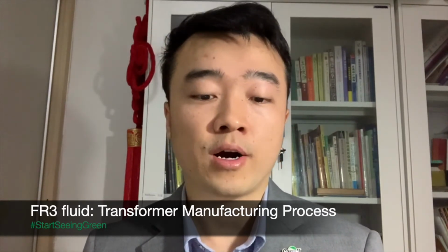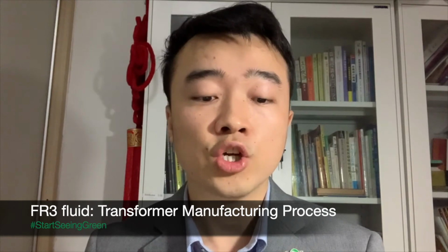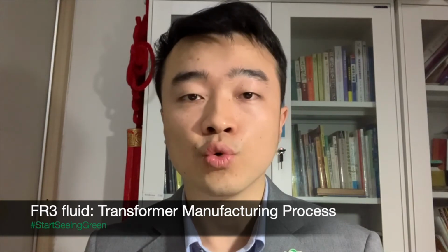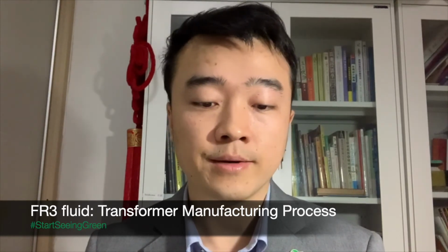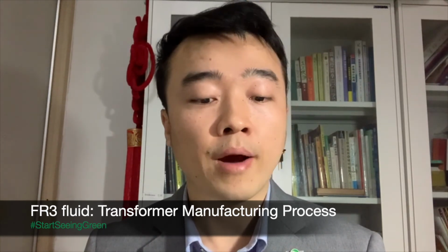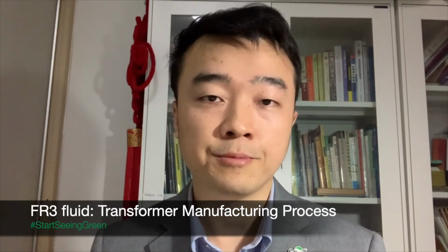Given the thousands of parts used in any individual transformer, as well as the extreme sensitivity to cleanness and other manufacturing details that manufacturers handle every day, the minimum precautions needed to avoid mixing liquids should not be a barrier for well-qualified transformer manufacturers. In fact, many larger transformer manufacturers have gone beyond the minimum precautions, implementing parallel storage and filling systems, which makes the production line very flexible.